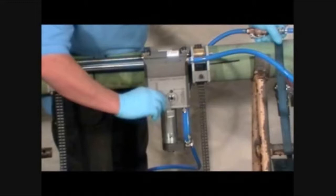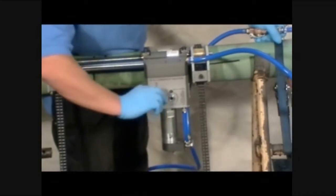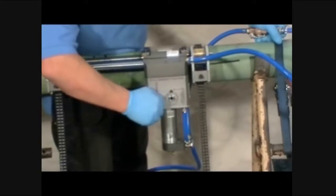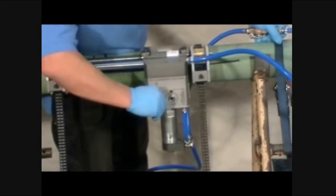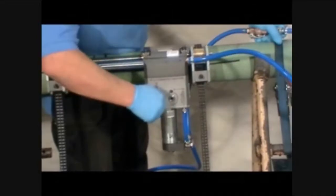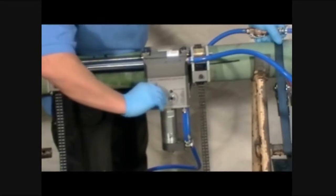Depress the dead man handle and turn the adjustment screw to the number of turns necessary to reach the predetermined pipe thickness. One turn clockwise on the adjustment screw progresses the blade to a depth of 1 millimeter. For example, if the pipe wall was measured to be 5 millimeters thick, then turning the adjustment screw for 5 revolutions would cut through the pipe. When the location of the inserted pipe is unknown, it is always recommended to cut just short of the thickness of pipe, leaving only a ribbon of metal.